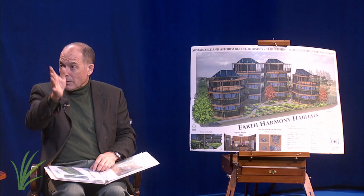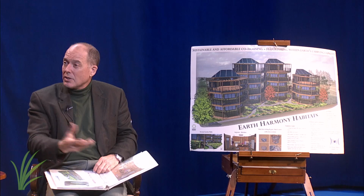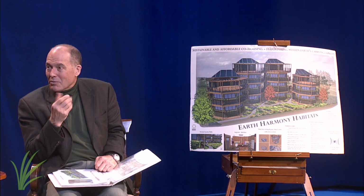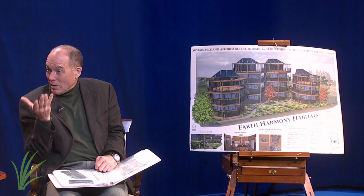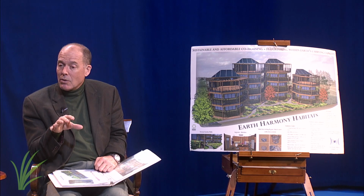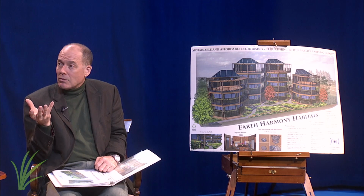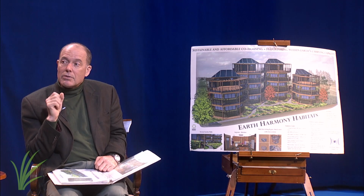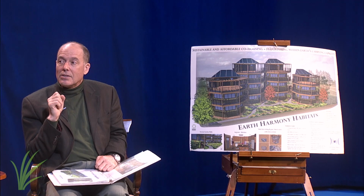And then that goes back into the house, and now you have fresh air, a lot of fresh air, over the course of the house. I've got one in my home. It's a great way to bring down the humidity of the home and have just great quality air. And what are they called, those ventilation units? Heat recovery ventilators, or HRVs for short.